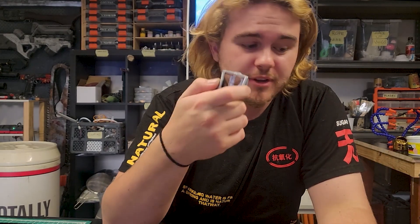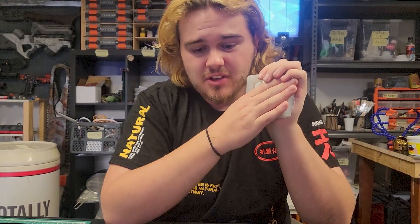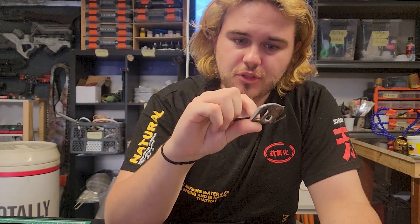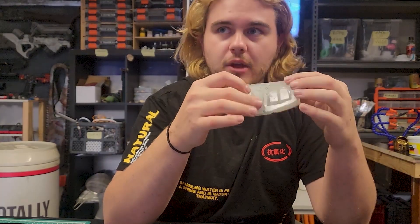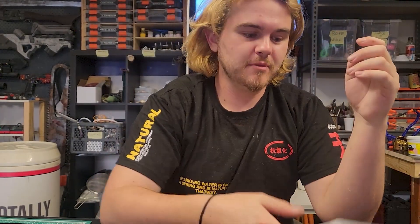I've got some new prints that I'm going to refinish and make a new mould of — eight of these — so I don't have to wait as long. These have an ambient cure time of at least two to three days, up to seven days to be fully solid, so I don't want to wait all that time with only four cavities. With eight I'll even have some spares, and if you're making things you always want spares — at least make one extra so if one breaks, you have a replacement.